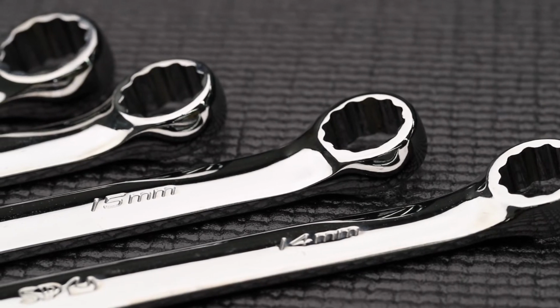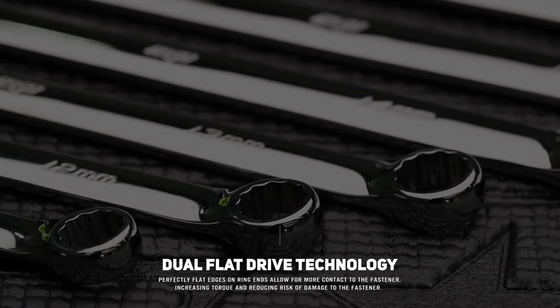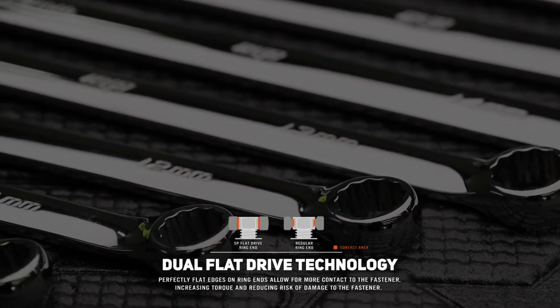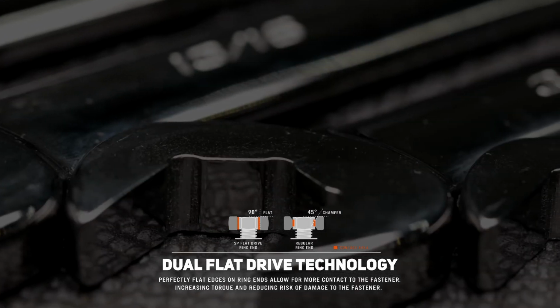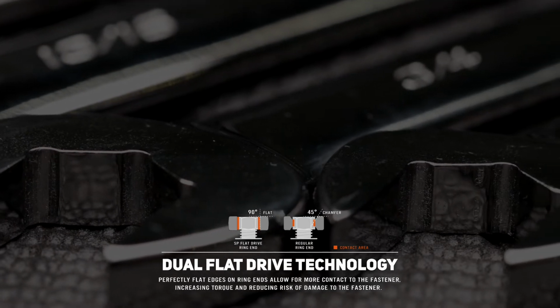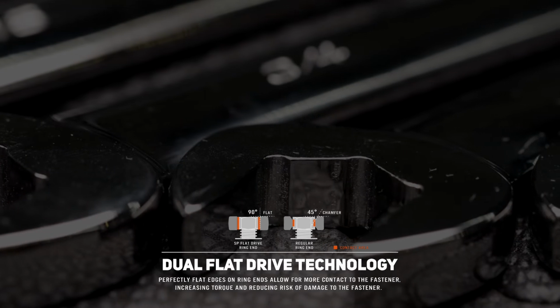The dual flat drive ring end. This feature has 2 parts. First, the unique shape of the internal ring causes the fastening force to be applied to the flat side of the fasteners rather than the corners. The second is the flat top and bottom of the ring end. By not chamfering the internal ring of the wrench, we have extended the length of the contact to the fastener. This is extremely useful when dealing with damaged bolts or where bolts are recessed and access is limited.